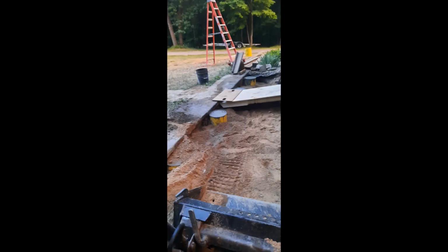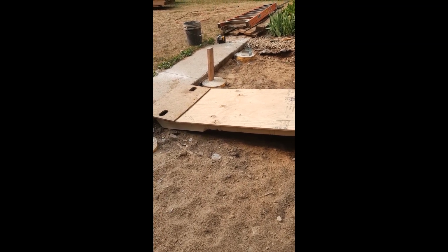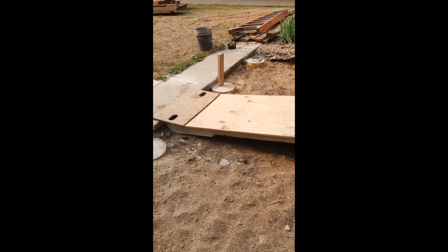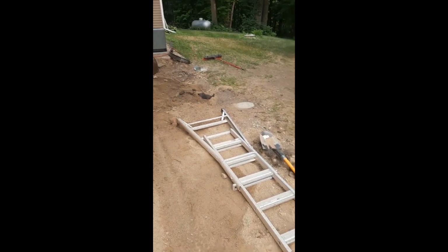Little update video. I was out here a couple nights ago. Got all the sonotubes dug in 4 feet down or more, and got them all poured. Yeah, so there's 8 of those. They're all ready to go.